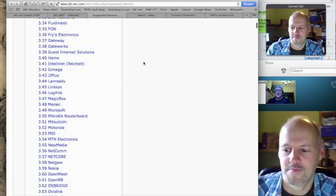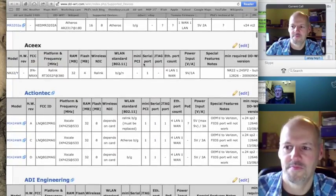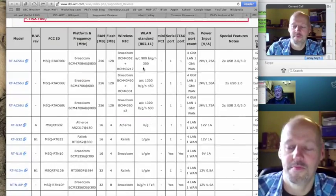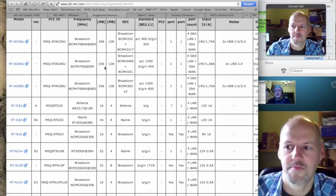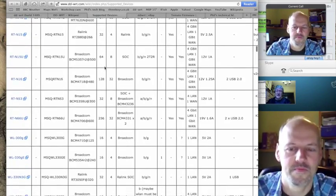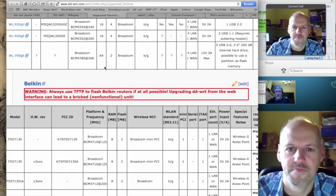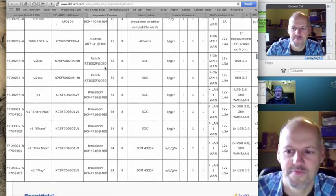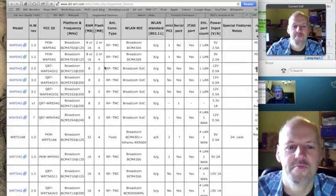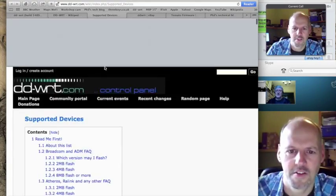If you go to the DD-WRT website, and I'm just scrolling that about on screen at the moment, it shows you the many hundreds of different supported routers by lots and lots of different manufacturers, and they're all essentially based on the same Broadcom 4700 series chipset, and they run a little micro install of Linux inside that little router, and they typically have 2 or 4 or 8 megabytes of memory. Very, very modest little configuration, very, very modest little 200 megahertz processor. It's an endless screen. I'm not even half the way down yet. Many hundreds of devices.